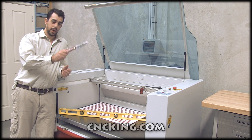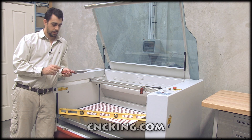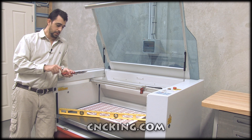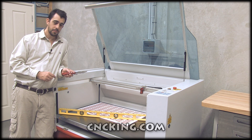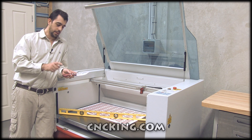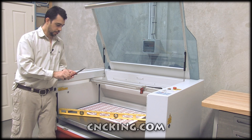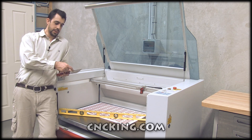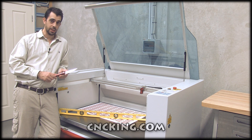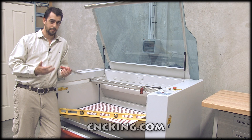Take a look at this knife — you have stainless steel and you have wood. Let's say you have 10,000 of these to engrave: you want to engrave somebody's name on the wood and a company logo on the stainless steel. Without a flex, you'd have to run it through a fiber machine, take them out, then do the wooden handle as a separate pass on a separate machine. With the flex, you use a jig, line them all up, and do both materials at the same time — saving an incredible amount of time, which not many people know how to fully benefit from.